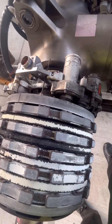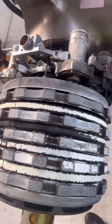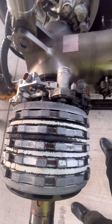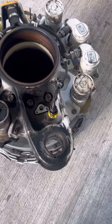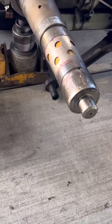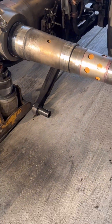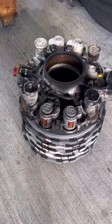As a safety precaution, never touch a hot brake. I'm only able to handle it now because the brake has completely cooled down since it was deactivated. The next step is to remove the brake rod. Once the brake rod is out, we connect our sling equipment and take out the brake. This is how our wheel axle looks with the brake removed.